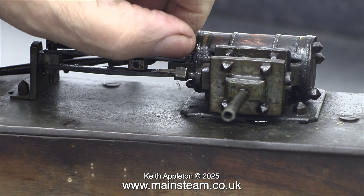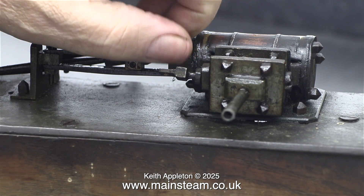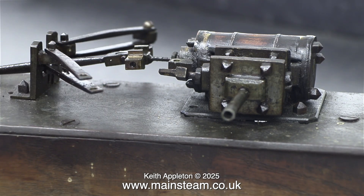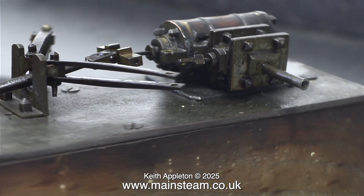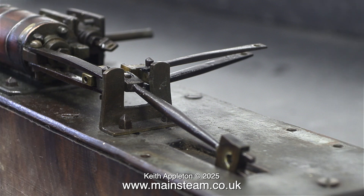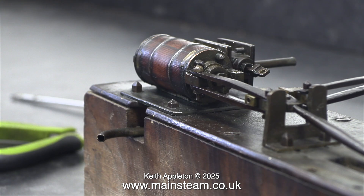At some stage in the life — or death — of this engine, someone fitted two dome head brass bolts to hold the crosshead guides to the bracket that's fastened to the cylinder. The other one's broken off. I will need to re-solder this using soft solder. It also explains why some of the cladding on the cylinder is quite dark in certain areas — it's where the parts were originally soldered to it, or maybe it was just a previous repair. Anyway, it needs fixing and I'll do that in the next episode.